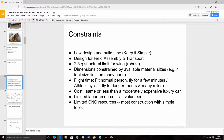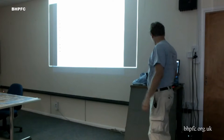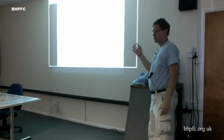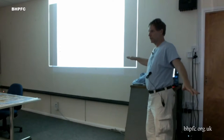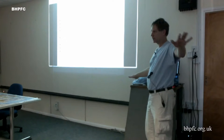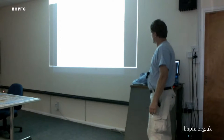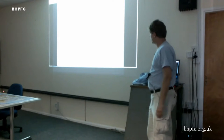And actually, we're deflection limited on the spars, so the spars are even quite a bit stronger than that in terms of stress limit. The thing that will break first on our plane is the lift wire, not the spars. And I've really been impressed with everybody's planes when they ground loop, including Voltaire. The wing bends and everything, but there's really not that much damage. The best thing you can do is just let it ground loop and do its thing. Anyway, don't worry about the rest of that stuff.